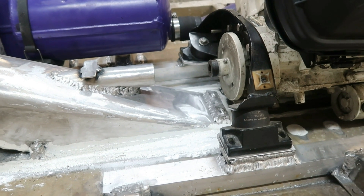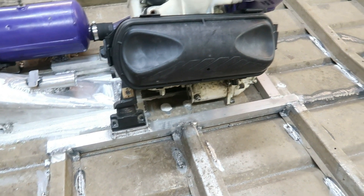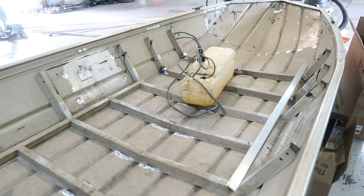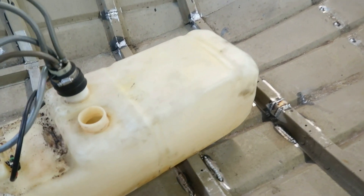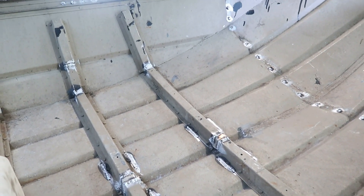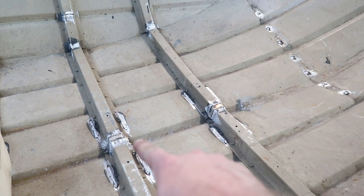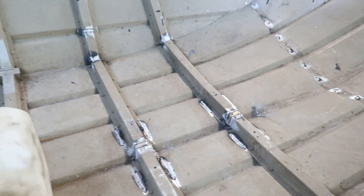It fit pretty good — just did a basic square tubing insert, all welded in. I also went ahead and welded all the way up the middle seams. Up at the front here, from the previous setup with the 20 horsepower, I actually had a bunch of cracks happen over time — we boat the ocean and the bay a lot, big lakes and rough water, and this thing was all cracked to hell up here. You can see where I welded — I had to sister the center pieces because they were so bad. When you weld two pieces of aluminum together it's real soft, so you actually have to sister them, and they don't do that from the factory at any of these seams.